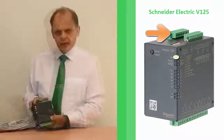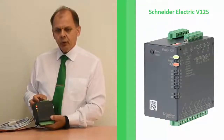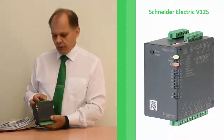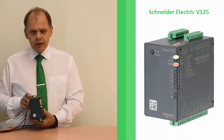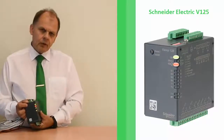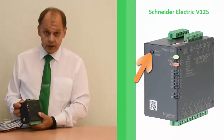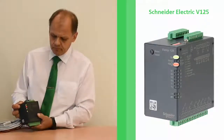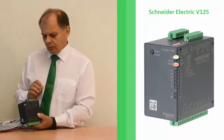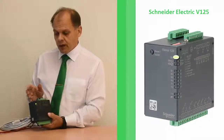In this case the device will go to maintenance mode. The reason is that we changed the configuration, and that means we have to do a reconfiguration of the device. That is done in a very easy manner — it is combined with the reset push button here. I need to press it for around 10 seconds and the relay will reconfigure itself. So I press this now. Now the maintenance LED disappears and the device is ready to be used.